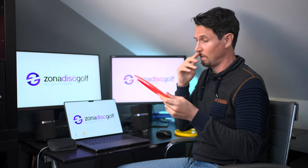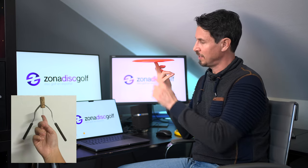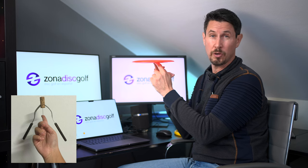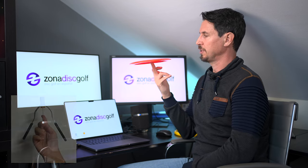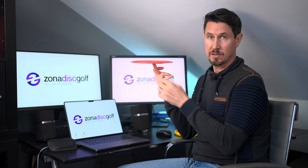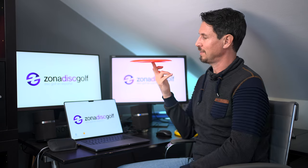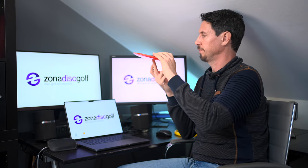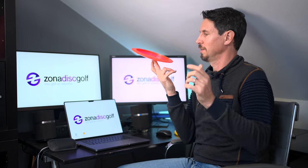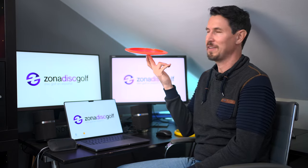It's easy to see if you try to balance this on your finger. If you put it like this, it gets balanced easily, because the center of gravity is below the fulcrum, the point of support. So if I make any alteration, it self-balances, because it's like those toys for kids — the center of gravity is below. And if you put it upside down, every small alteration gets magnified, because the center of gravity is higher than the fulcrum.